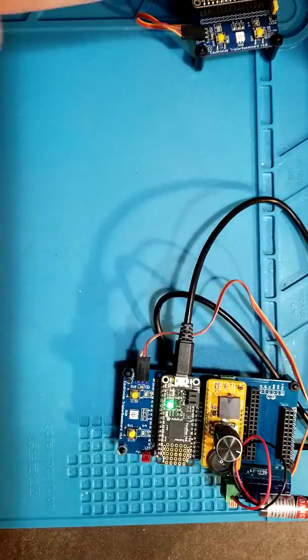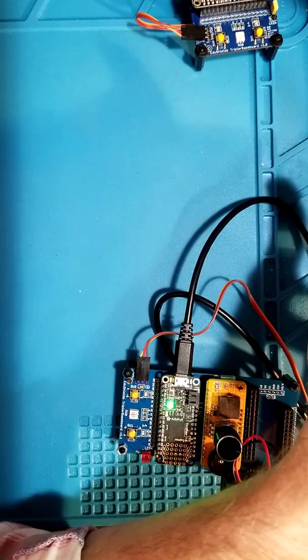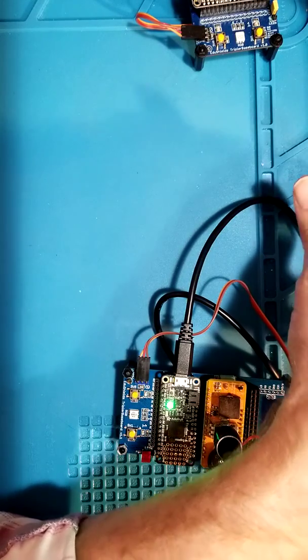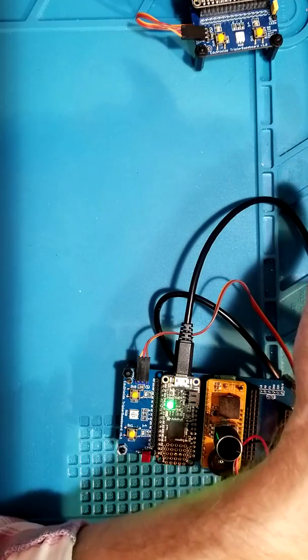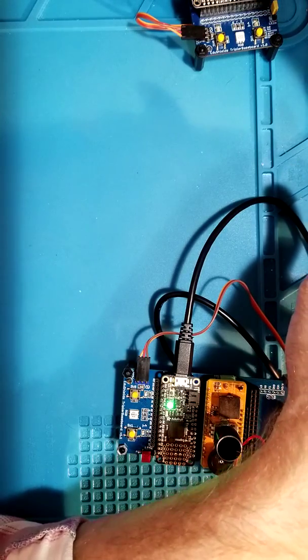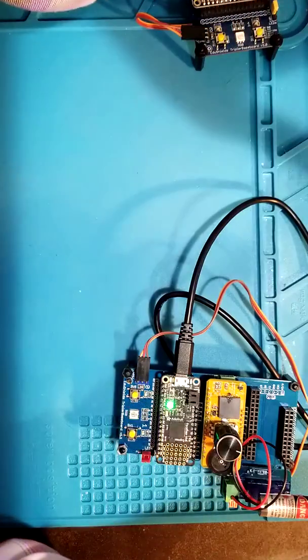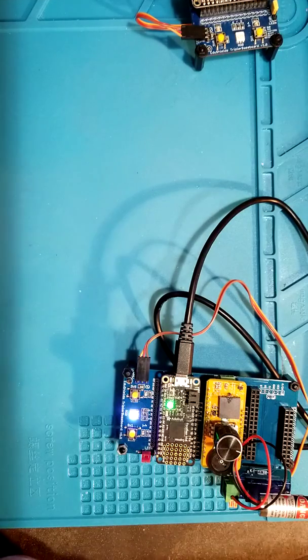So the order is, I'm over here in my code window, I make some changes, and I want to run it again. But I also want to see the messages. So before I hit save, I open up a new serial window, I click in the code window, I hit save, and not only do I not miss my messages, but I get them, because if you had reset the board in some fashion, the serial window basically would have been dead.